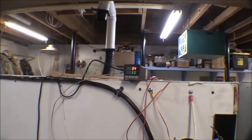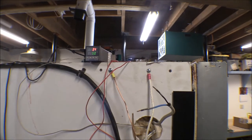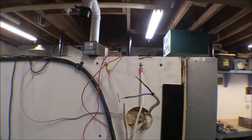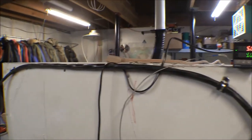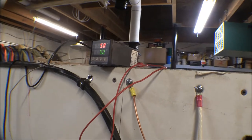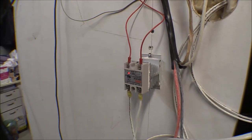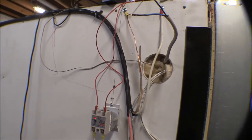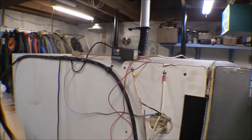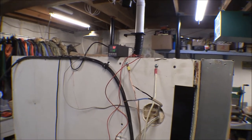The clock back there says 25 after 8 - we started at 20 minutes after 8 and went from 22 degrees to 35 degrees in 5 minutes. It's right on 50 degrees now after 20 minutes, and it's cycling on and off but holding right about 50-51 degrees. The burner's not quite as bright - you can see it glow then drop down a little bit. It's been 55 minutes now and it's starting to settle down.